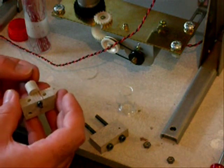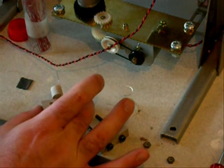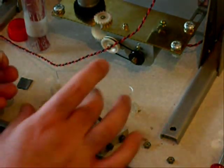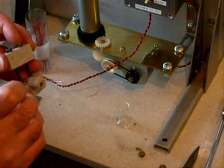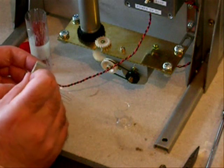This is the jig that holds the wires and stem tube in position when making the pinch seal. It is made from sindanyo board to withstand the annealing oven. The jig is held together with stainless steel nuts and bolts.